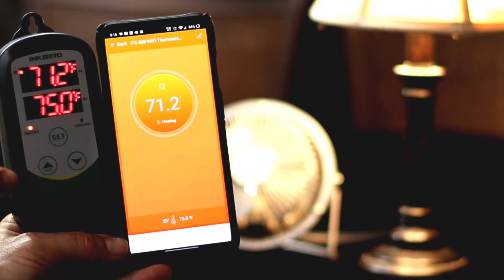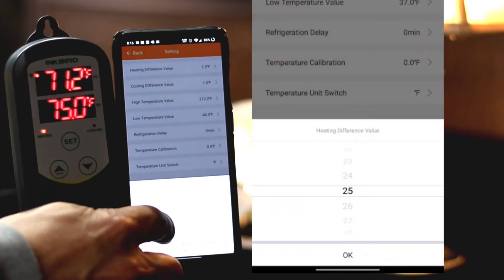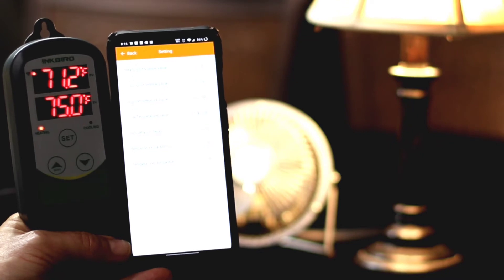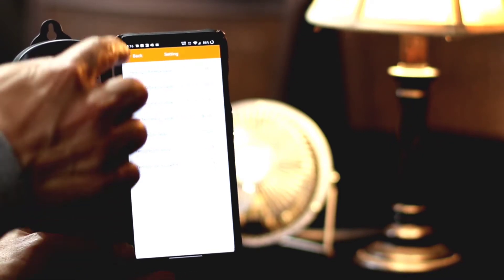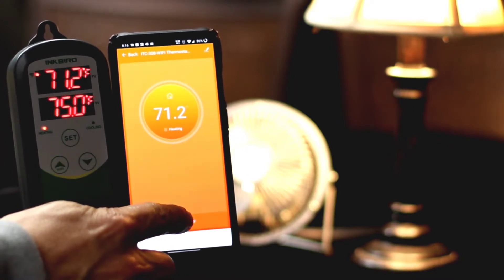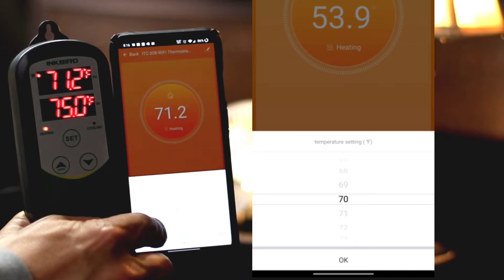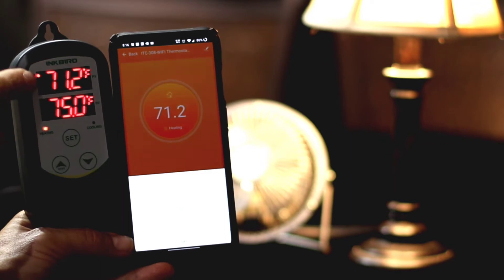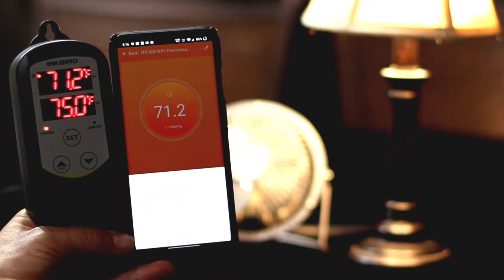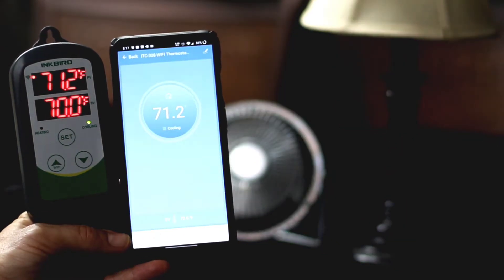This unit will monitor your set values for your heating differential — you can set that from 1 to 30 degrees. We'll set it to 1 degree for testing to see how the heating sets on and then shuts off and switches to cooling. Right now we're in heating mode because we're lower than our set temperature. We can easily change that by going to your set point — we'll drop this temperature down to 70, select OK, you'll see this flash from the app update, and this will switch to a blue screen indicating cooling. You'll see this light turn off and the cooling light turn on.